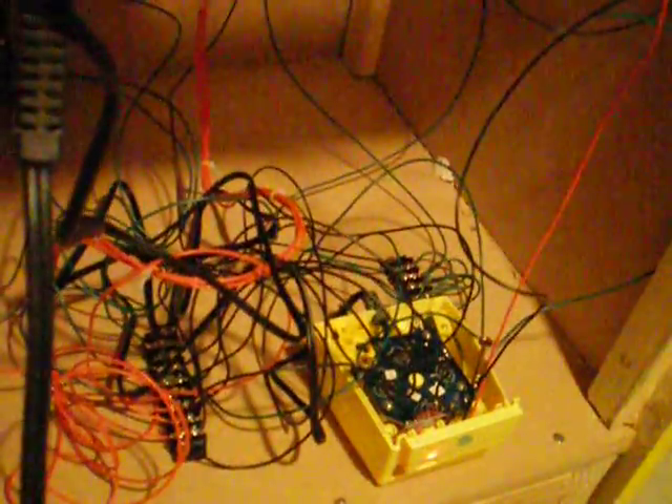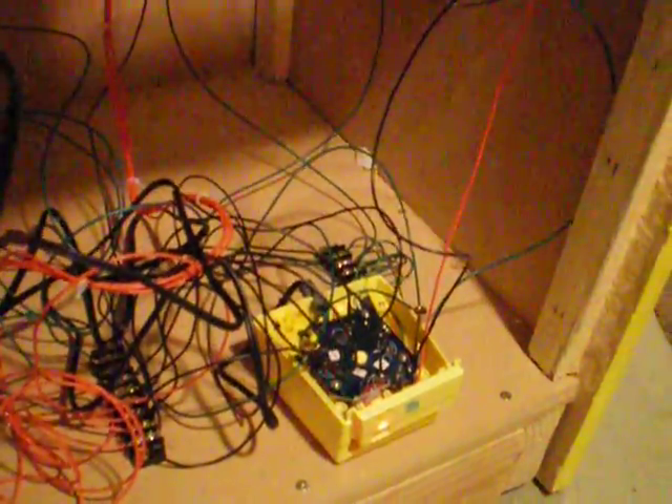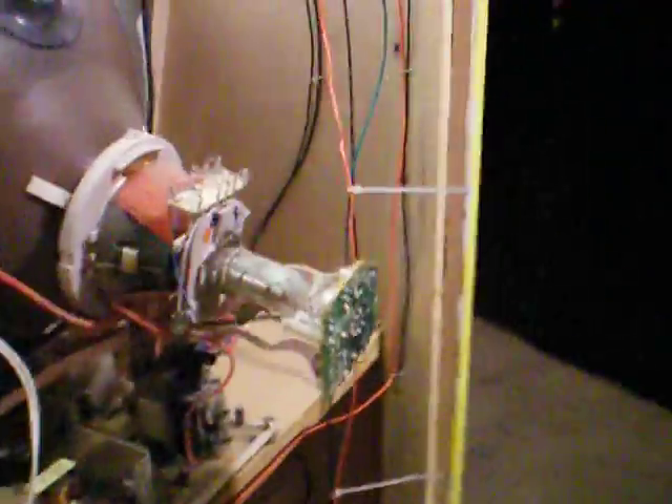It's a very simple setup. All you have to do is find which button does what — they're marked on there. Splice some wires, add a couple beads of solder and you're good. That could go for any game. If you want to do it on the cheap, just go buy a $20 game rather than a 48-in-1 — get one of those multi-Galaga Pac-Man monstrosities and hot-wire it into something like this. Build it for your own kid. All the wires right now are run out through a hole rather than simply cutting it to fit — I'll get around to that, so it's a little bit ghetto, but it works.